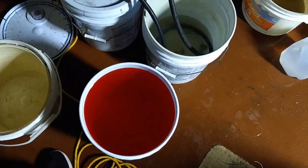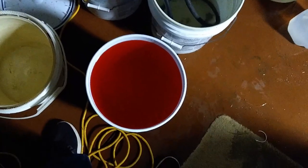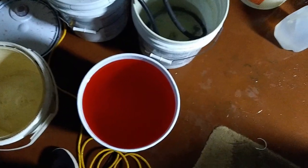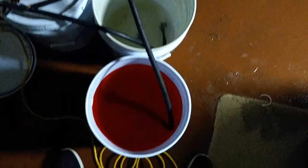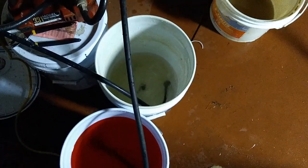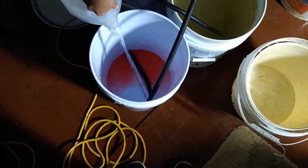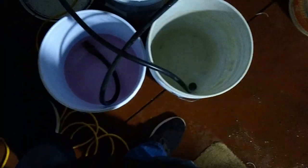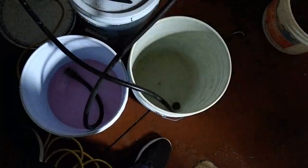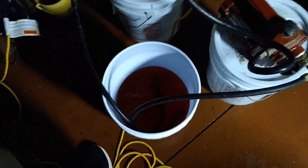We're going to fill this with the new 100% propylene glycol. The way we mix it is in equal parts as it flows through the system — it will start out clear, and when we see the red come through we know we've gotten our portion through. We drain the five-gallon pail, then fill it with five gallons of distilled water and wait to see when that comes out. So we're sucking from the glycol and still discharging fresh water. Once five gallons of glycol are added, we add five gallons of distilled water into the same bucket in that order. We're now at the bottom of 10 fresh gallons and still don't see any red coming back out, so we continue mixing the 50/50 propylene glycol and distilled water throughout the system.